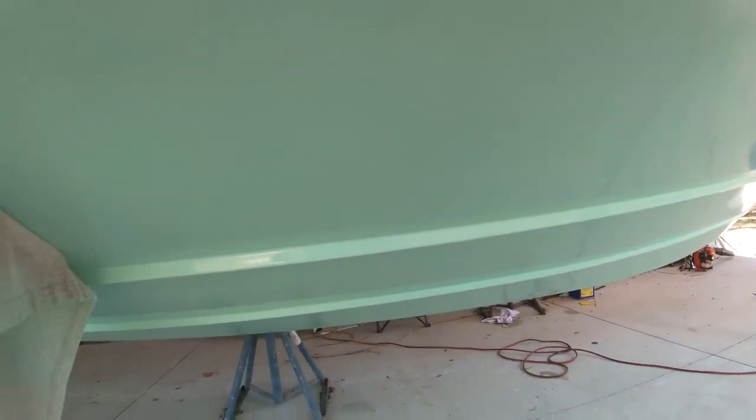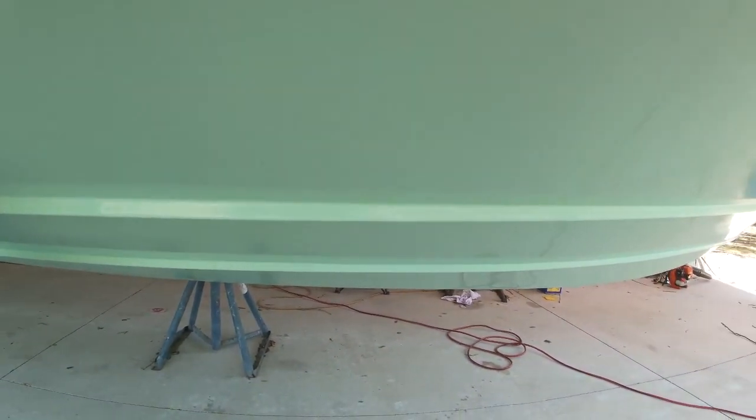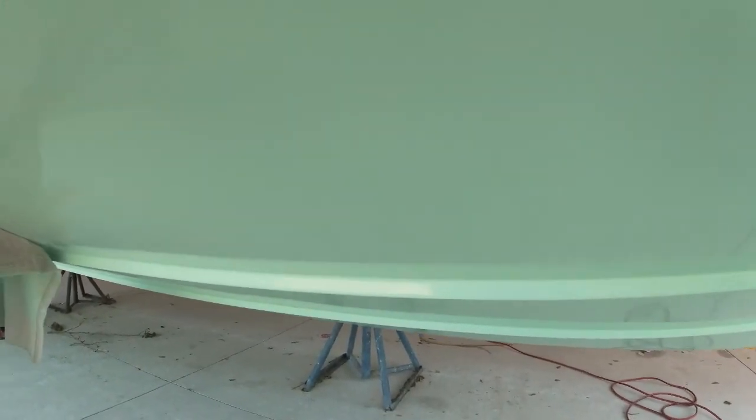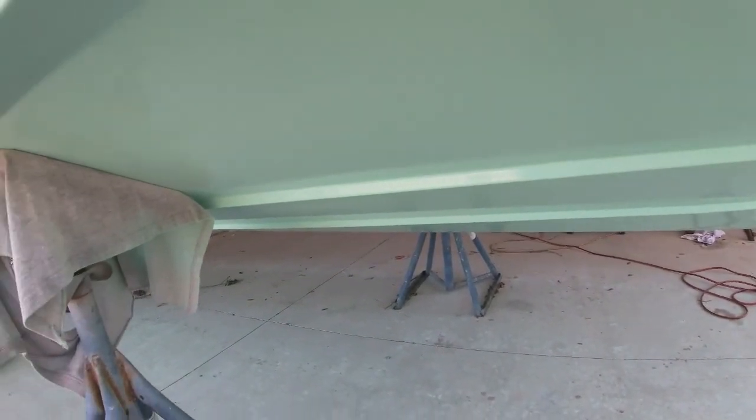So now we have a finished product. We've wet sanded it, and on the bottom we just used that polish one time and buffed it out — that's our finish. It's a pretty good finish. It's not mirror-like the top, but it's the bottom of the boat. It's all even, no orange peel left on it, and we're good to go. So that closes out how we finish the paint with all the sanding, wet sanding, and then back up to the polishing. Remember, once you get all the polishing done, you're going to go back and seal it with a coat of wax — Woody's wax or whatever marine grade wax you'd like to use.